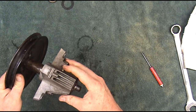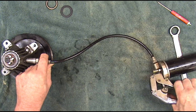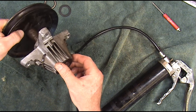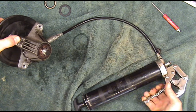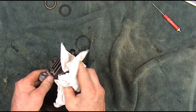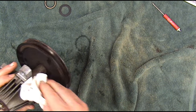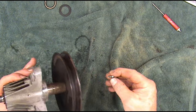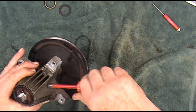That's real smooth now. So now we're going to put grease in here until it starts to come out this hole. You can see that it's full because we're losing grease out of our seep hole. Go ahead and hit it one more time — yep, it's full. So now we're going to wipe all this extra grease off of everything, it'll get all over you when you're trying to put everything back together. That last pump had a pretty solid stream coming out that little seep hole. I'm going to go ahead and put this screw in the seep hole, and that'll keep water and debris out of our bearing.